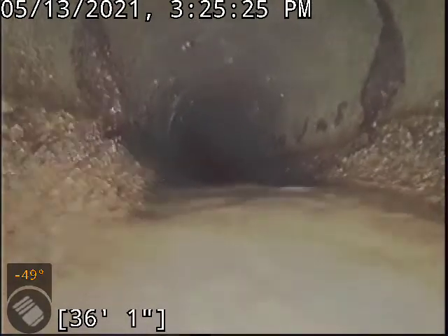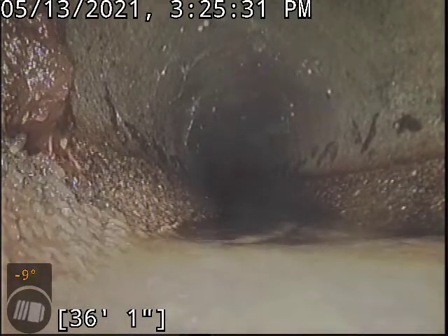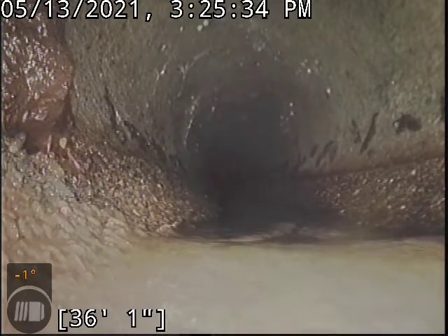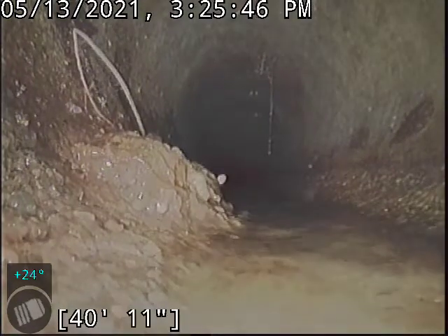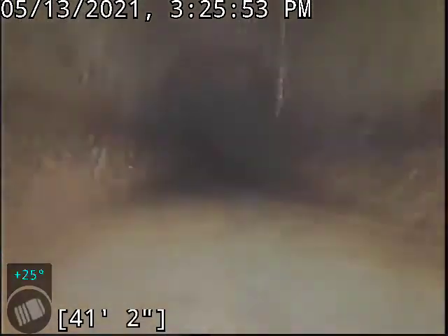You've got a joint right here. It appears to have dirt coming through it, and I can see earthworms moving in and out of it. They're very small, but you can see the tail of two earthworms sticking out there. So that joint is compromised. It is not affecting functionality as far as flow goes. You've got another one right here doing the same thing, and that does appear to potentially have roots sticking out of it.